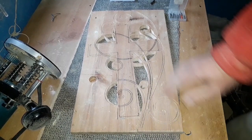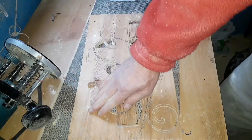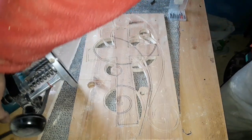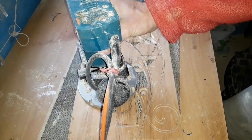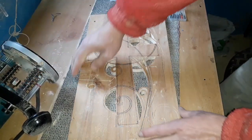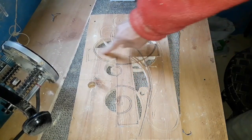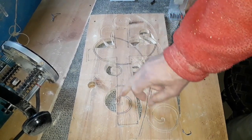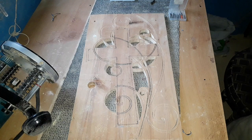We've removed all the paper and everything's cleaned up. We've put all the surround pieces back in - that's literally acting as a base for the router, giving it more room to work without damaging the curls, just as a temporary framework. The idea now is to remove all the centre of this cross, going on either side of our little twirly lines, a couple of millimetres. We don't want to go too deep - the deeper we go, the more resin we're going to use.